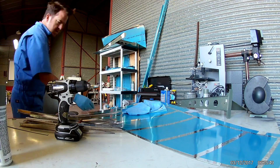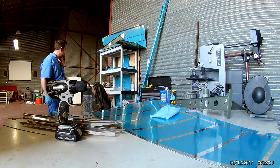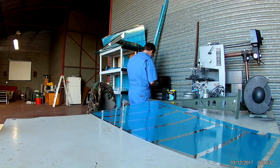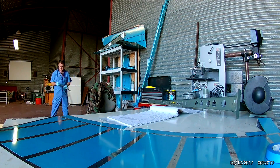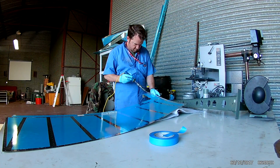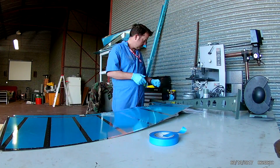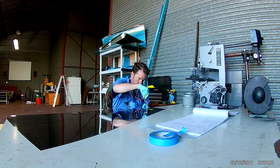What you'll see me wiping the metal down with — originally I had been using acetone to clean all of the aluminum skins. The problem is acetone will leave a slight residue and it does take longer to dry off. I have since switched to isopropyl alcohol, or rubbing alcohol. Dries faster, leaves no residue.